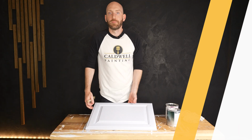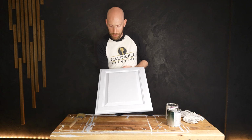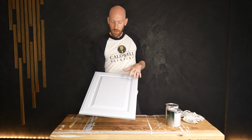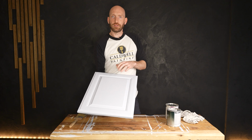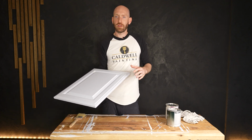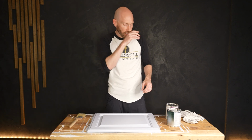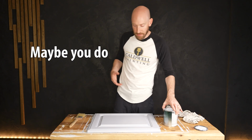in just a second. All right, so our first coat's dry, and it's looking pretty good, but the thing with doing a second coat is it's going to help level into that first coat. And also, when you're brushing it on and you think you got full coverage, when paint's wet, it's much thicker. When it dries down, it gets tighter, it kind of shrinks as the water escapes it. So what you think you may have fully covered may turn out that you don't.